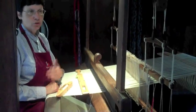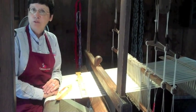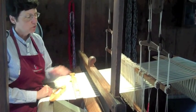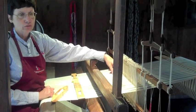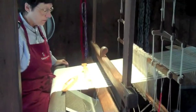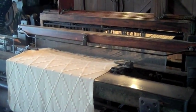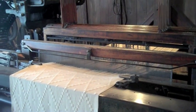Eventually we're going to add power. Starting in the 1700s, the Industrial Revolution is going to come into play, and we're going to add water and eventually steam and electric power to the looms. They're going to work basically the same way, but we're going to speed them up and make them very efficient. The loom behind you now is an electric-powered loom from the 1920s, used in the Highland Park Ford factory in the area. It was used to make upholstery samples. Using electricity, you're going to weave about 25 feet an hour instead of just one foot.